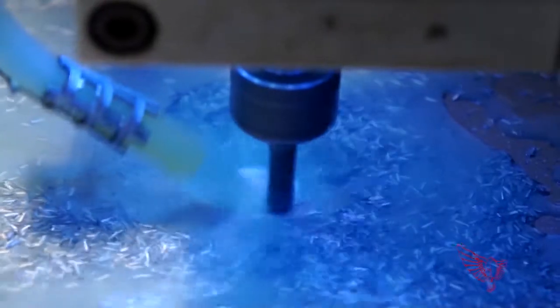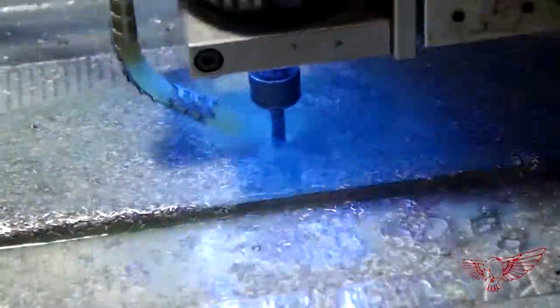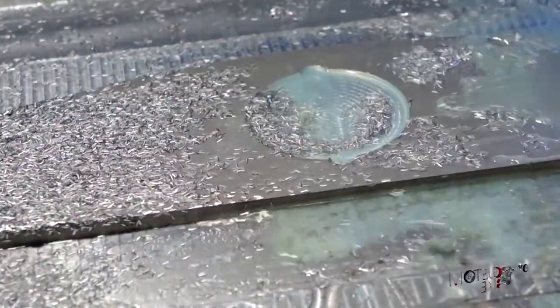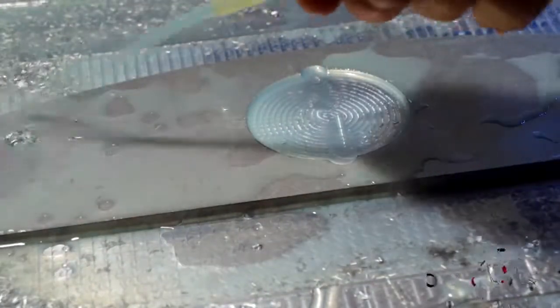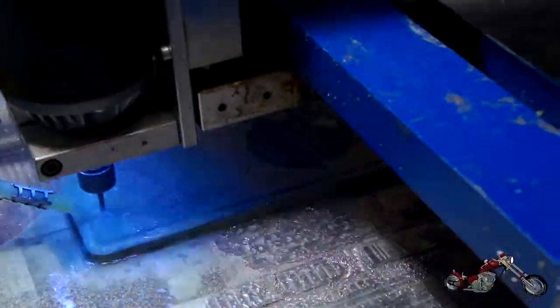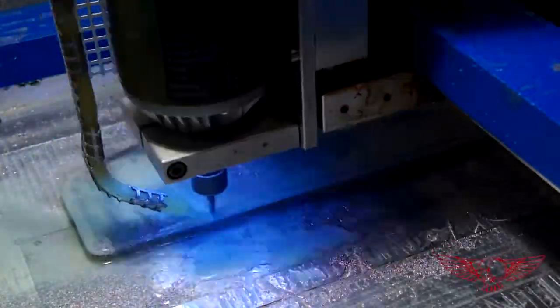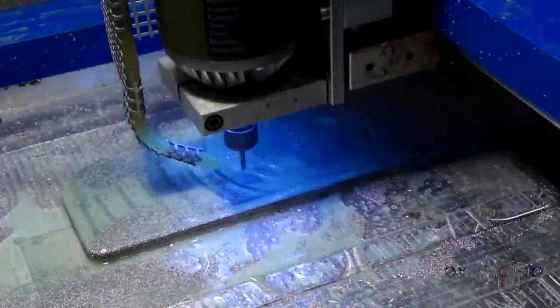One of the goals in prototyping a production line is optimizing the toolpath for high speed and quality finish. I start with the pocket for the medallion, which in my case will be made out of copper, just like all the rest of the accents on the bike. Once the pocket is done, I continue with the carving of the other design elements, like the concentric lines. To complete each line I need to do multiple passes to reach the final depth. I hope the upgrade will bring them down from 5 passages to 1 or at most 2.